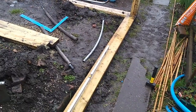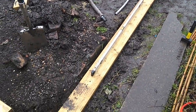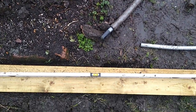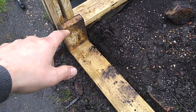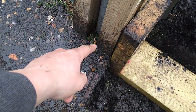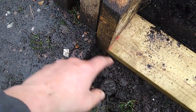I've got the front side, or door side, base plate in - and that's the 6x2 tanalised. You want to get that level. Now, because of the drop-off of the slope on the allotment plot, there's a difference in height between the left side, as you look at it, and the right side. So I've had to get that level. Because of the drop-off, the timber's ended there when I put these supports for the trampoline frame in.